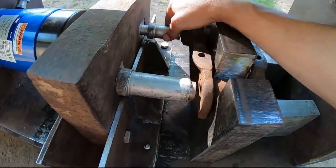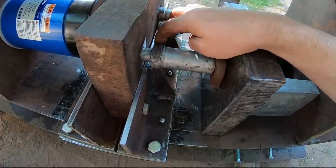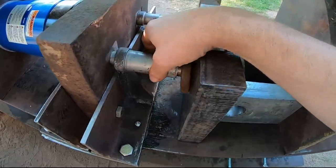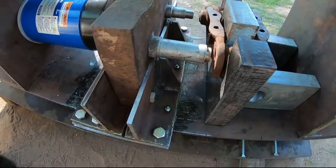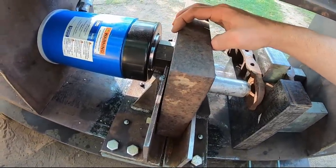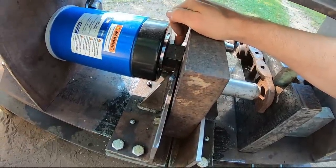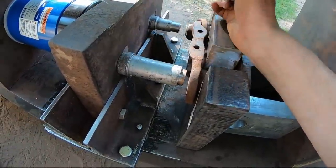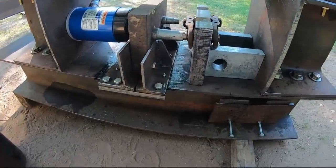Another potential weak point is the 1-inch diameter shanks that are on each one of these adapter pieces, even with the rather large shouldered area just beyond them. And I milled two absolutely flat recesses in there, so we have very, very good support. We're just going to have to see what happens. I'm pretty sure I'm not going to overwork this 2-inch piece of steel with my pressure point from the ram in the center versus two other pressure points that are going to transfer the force slightly out from that. We're just going to have to start putting pressure on things and see how it's going to work.